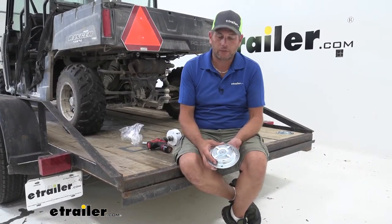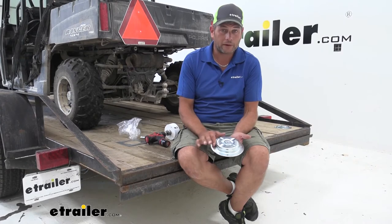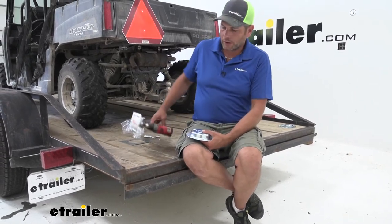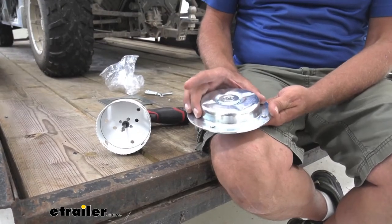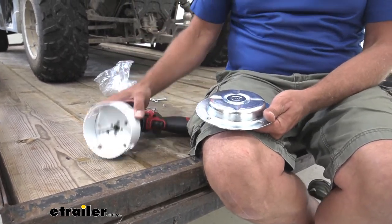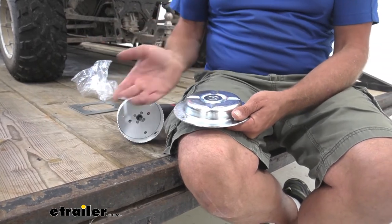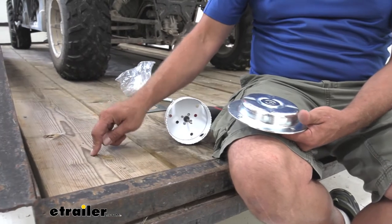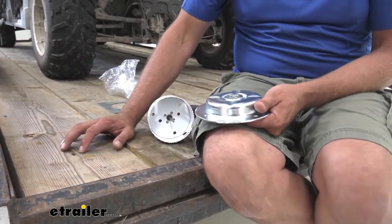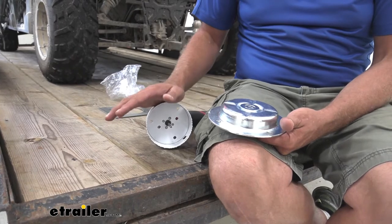Now for your installation process, there's kind of two ways you can go about it. This is going to be about seven-eighths of an inch thick from where it mounts to the bottom. You're going to use a hole saw regardless. The part that's going to be recessed is four and three-eighths of an inch, and again seven-eighths inch, so about an inch thick. You can use your hole saw, mark it, take it down about an inch, and then chisel out the wood that remains in there. Now, I like to go all the way through — that way I know there's not going to be any water sitting in that recess. If you did want to recess it and leave some wood in there, you could drill several holes through it to give it an area to run out. But I think it's simpler and easier just to go straight through.